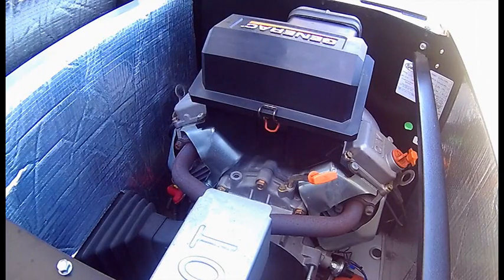I did research on YouTube and found that the liquid cooled models, starting at 25 kilowatt, or whatever they're rated at, need the coolant changed at least once a year, maybe every 2 years, I think, because the corrosion inhibitors in the coolant deteriorate. Unlike a car, which is always running, they just sit in pockets and everything. So it's sad.